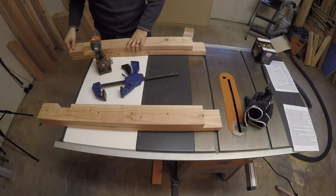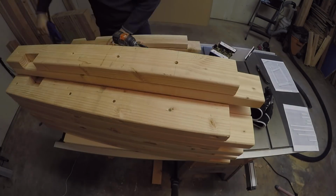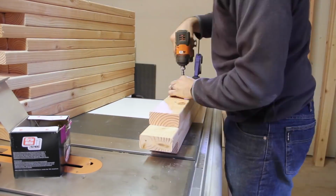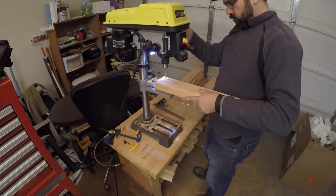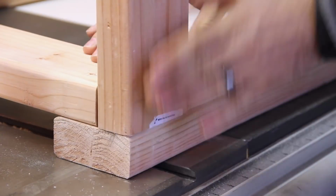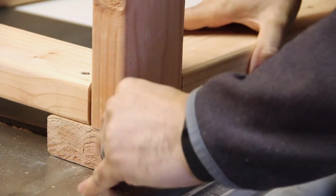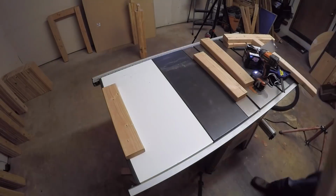There were 2 sets per assembly and 7 assemblies total. This set was a double stack that connects the longest run in the workbench. I drilled out holes on the cross members to attach the leg assemblies. Again, using a scrap 2x4 gave me the exact dimension I needed to half the board. Now I could screw in the upper cross members connecting the 2 sets.